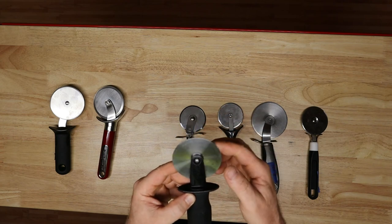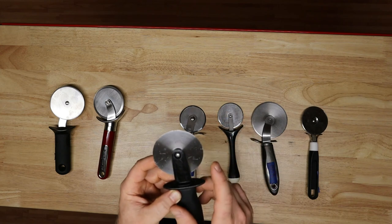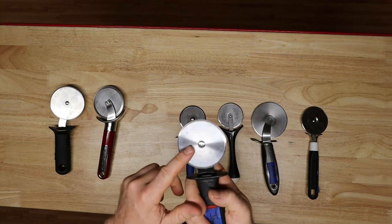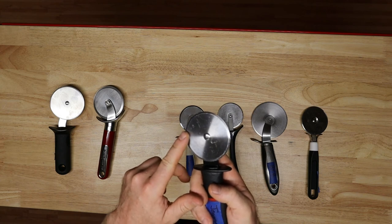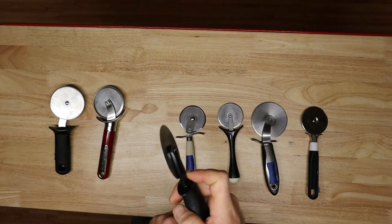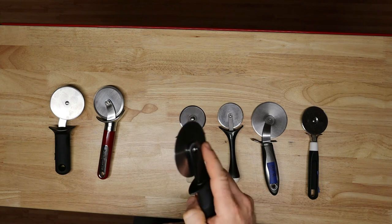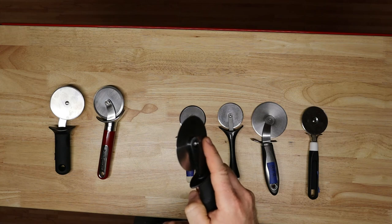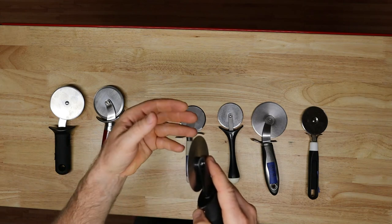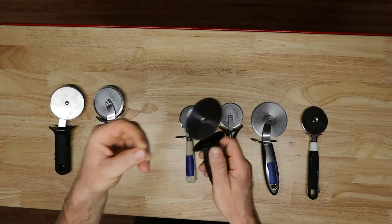And that's how you get the cut around the whole circumference. What you really need is relative motion — with a 1x30 in mind, relative motion between the belt and the blade. So if you touch the pizza cutter to a spinning belt, the blade will spin up to the speed of the belt. But if you slow it down a little by braking it with your finger, that'll induce relative motion — the blade will move slower than the belt — and that's how you get the grinding action. So that's how I anticipate doing some of these.